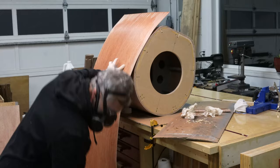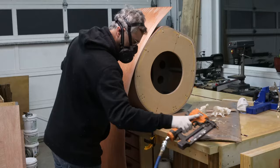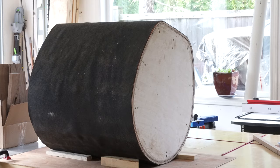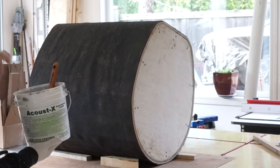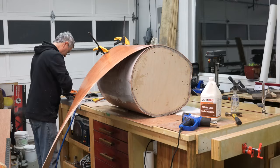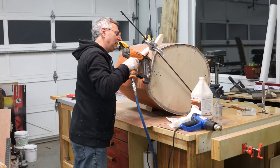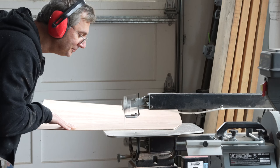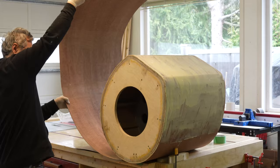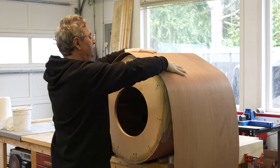Very stinky material — that's why I'm wearing my respirator for this. The next layer is a quarter-inch rubber, covered with acoustics on top, and between the two it created a nice rubbery bond. After the fiberglass and rubber the speakers got very, very heavy. Here goes another layer of plywood on top. This is the very back plate to cover the back, which also makes it even thicker. The very final layer had to be mostly glued — I did not want to put nails in it, so there was a lot of scoring in that piece to make it bend easier.